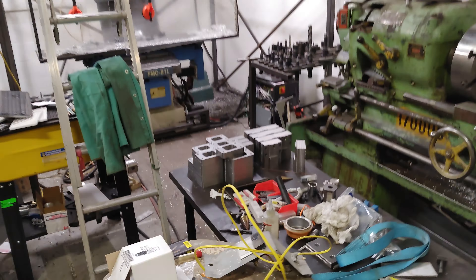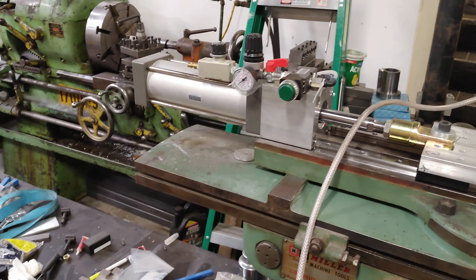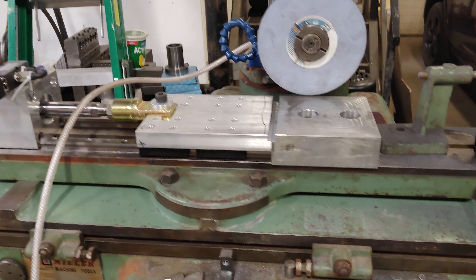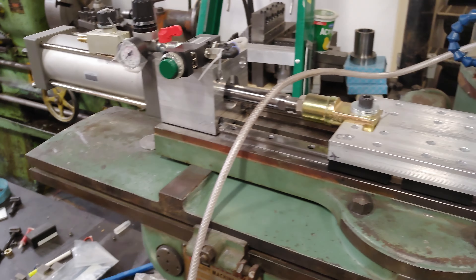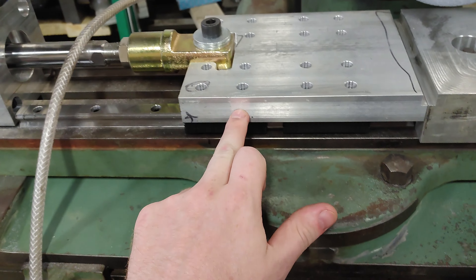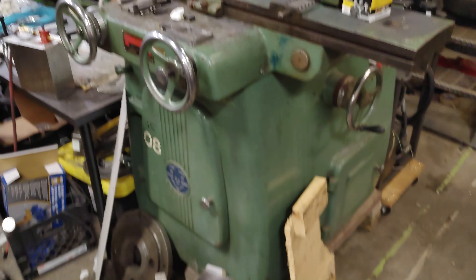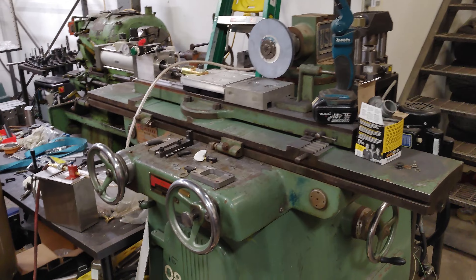So I'm going to do more videos of actually machining things. My surface grinder — I recently made a new magnetic vise for it. I didn't have a magnetic one and I just had all these parts lying around. The movable part is on linear rails so when it clamps it doesn't lift. It actually works fairly well. I paid $300 for this whole surface grinder, so it's probably worth that in scrap weight, but it does work.